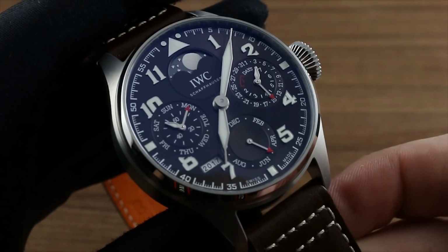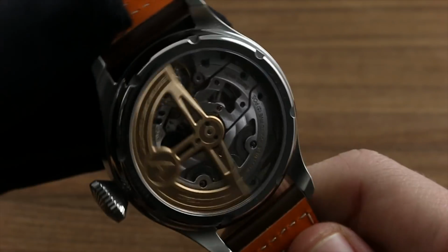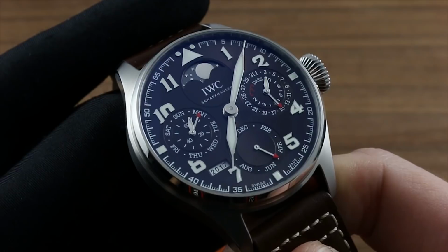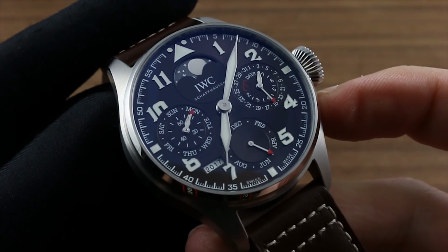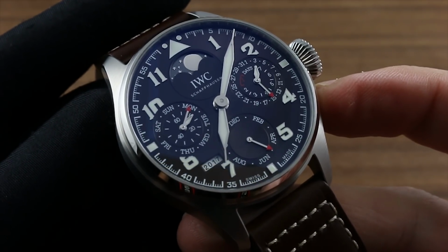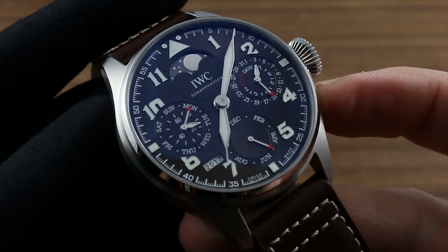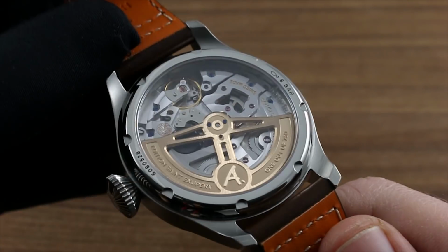Magnetism is ubiquitous and unseen, but it is also a hazard to your watch. The ferrous hairspring at the center of your watch's balance can become magnetized. This will result in erratic timekeeping, either fast or slow. But in any case, it can be remediated at an IWC authorized service center with specialized equipment. Keep the watch remote from the closures of wallets, purses, and refrigerator doors, as well as speakers, subwoofers, high-powered electrical systems, and MRI equipment.